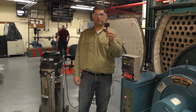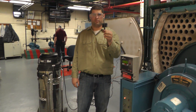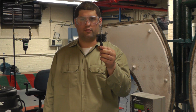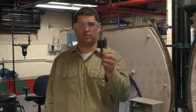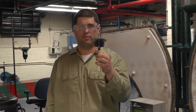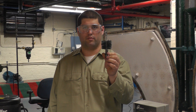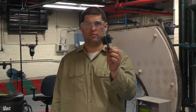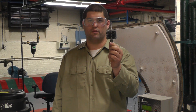The idea of this brush is, if you can see it, it's got a lot of space between the bristles. They're very stiff bristles with enough space to allow the soot to be pulled right through the brush. So rather than having a dense brush and pushing all the soot down the tube and out the back end of the boiler, you've got a brush that's going to allow you to suck right through it and into the vacuum.